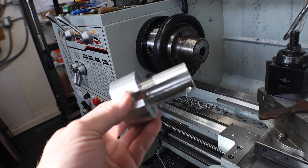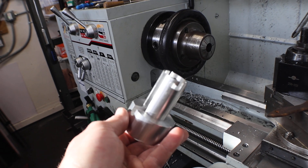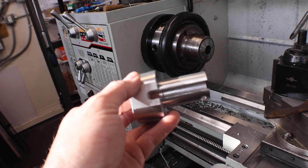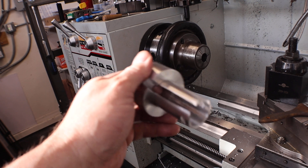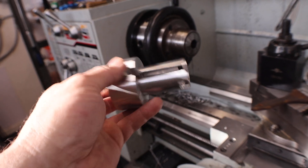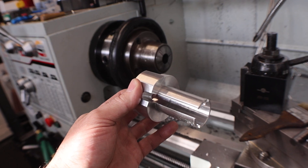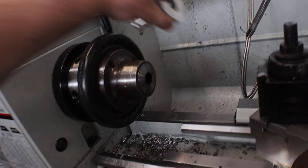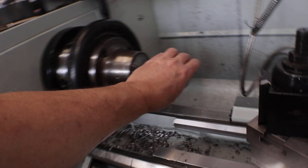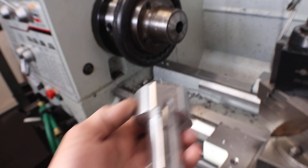I don't have the actual dimensions of the part they're doing, but just from walking by and seeing it, this is essentially what it is. It started off as two-and-a-quarter inch diameter round stock that I turned in the lathe, and then this diameter here is an inch and a quarter. So it was solid across here and I did all the work like this, then I parted it, then I flipped it — and that's where these big collets come in. This is the 22J collet system, and this is an inch-and-a-quarter collet, so I put it in here and faced it.